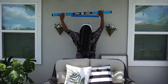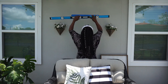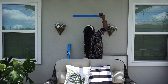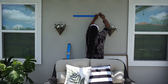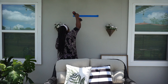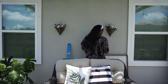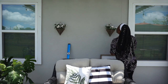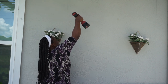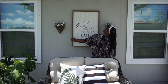Then you're going to put it on the wall and use a level to make sure your tape is level. Mine was a little off so I'm just going to lift one side and recenter again. Checking one last time — got it. Now that you have your tape level, you're simply going to take your screws or nails and drill it right into the dot or the hole that you made on your tape. I just pre-drilled a little bit because the tape was getting caught on the screw. Then I took my tape down and now on my wall I have my markings of exactly where my screws go. Simply screw those in and hang your picture. And that is how you get a perfectly centered and hung picture the first time, without making multiple holes in your wall.